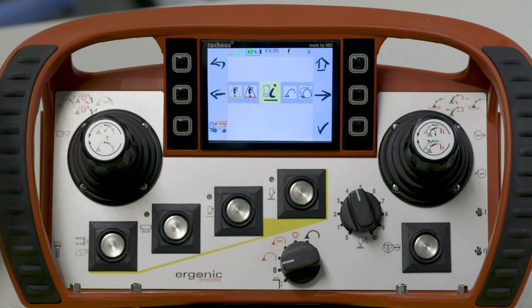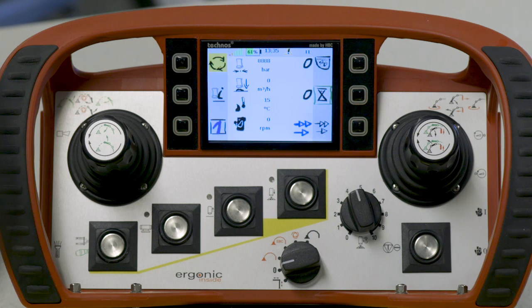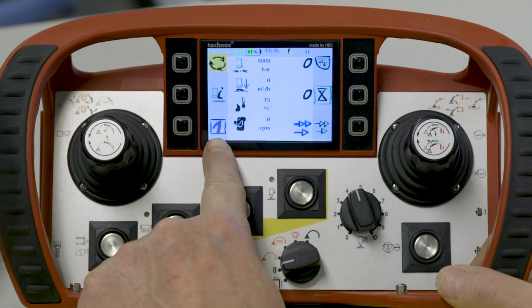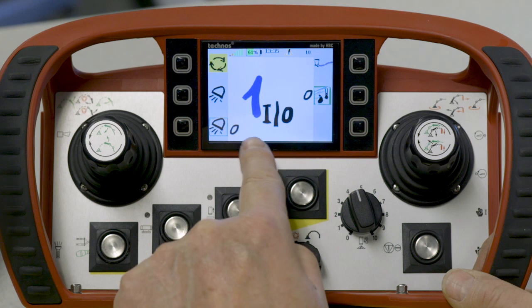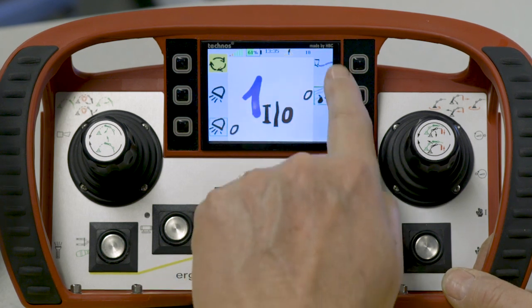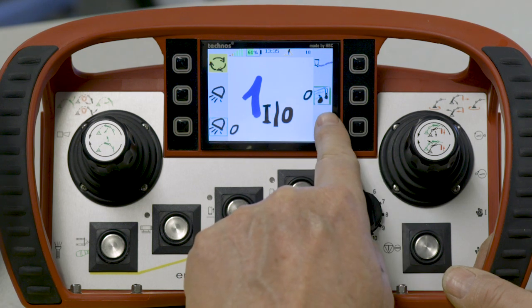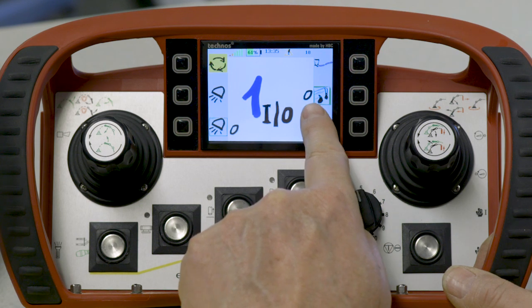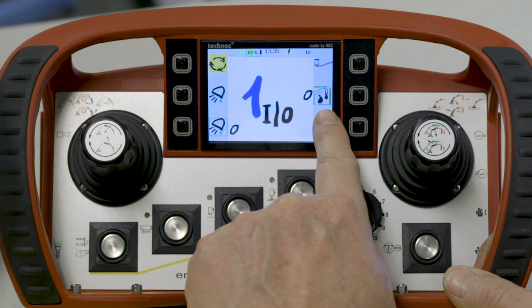From our pump menu, we have a new symbol: a little drop of oil with a thermometer and blue streaks running through it. This is your oil cooler fan symbol. With it off, the oil cooler fans — between one to three fans depending on machine — will run thermostatically controlled by the processor. But if you know it's going to be a long, hot, humid day and you want to turn them on in the morning and have them stay on all day, you can select it. With the engine running, this would change to on and turn on all of the oil cooler fans all day long.